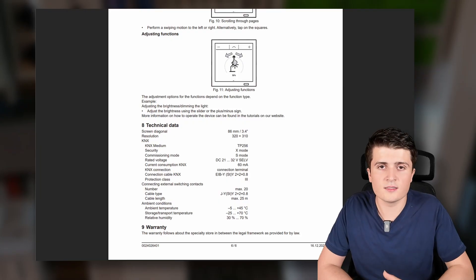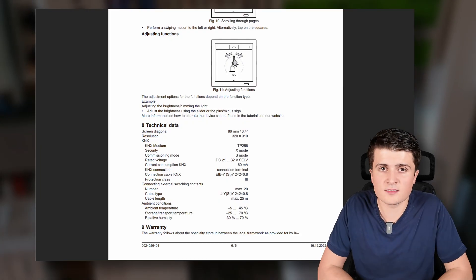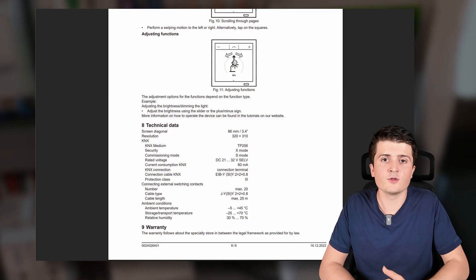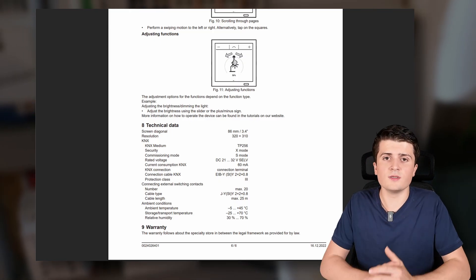For example, a KNX display that has no additional 24-volt support and only uses the KNX connection can take much more than 10mA — 60mA to be precise, as shown in its datasheet. Normal push buttons take around 10mA, while actuators may only need 4 or 5mA. There is an easy way to check device current without reading every datasheet.